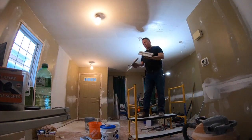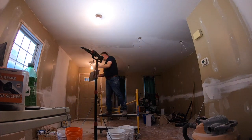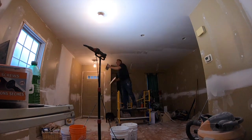Now, once we're done that, my dad's going to just tape the entire coat over. While we're scraping, we do get a couple gouges in there. We do get a couple pieces of popcorn ceiling that were a little difficult to remove. So he's going to take a very thin pass through the entire ceiling, and we're going to take 2 passes through with 1 coat of sanding in between.